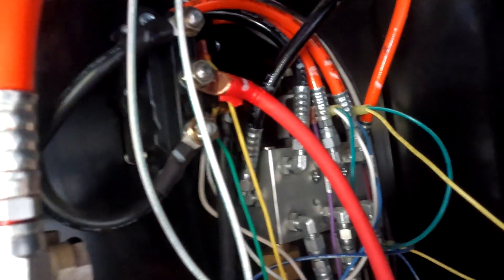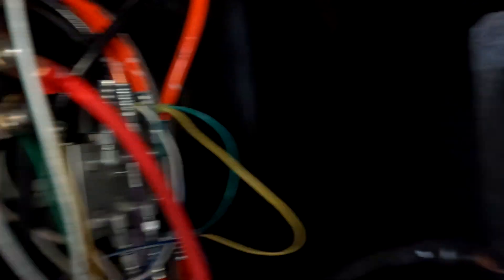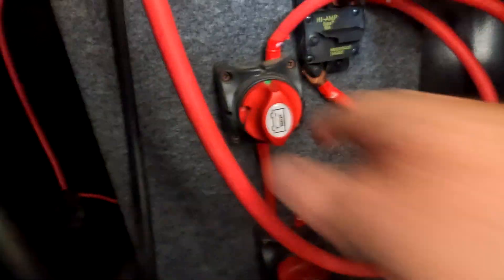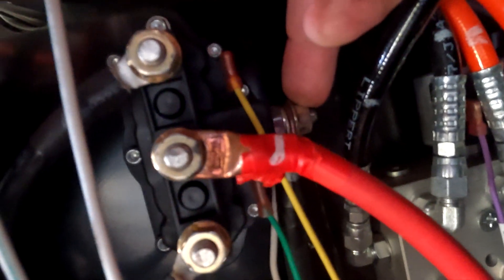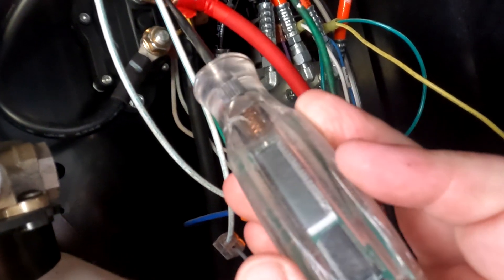The first thing we need to do is ensure that the electricity is turned off. This is a 12-volt system — it's battery operated — so you can simply turn off your battery switches, which I'll do right now. Both of those are off. To ensure that we have no power, the bottom stud on this side right behind the positive lead is going to be your negative. You can hook a test light up to it with a simple clamp, hit your test light to the positive terminal, and as long as your test light does not turn on, you'll be sure there is no power going here.